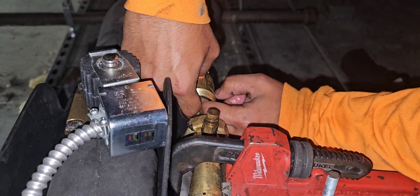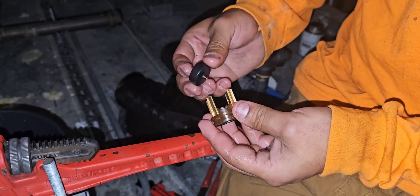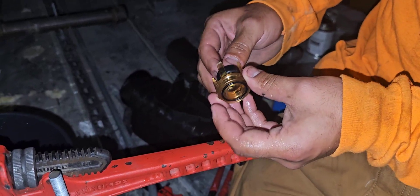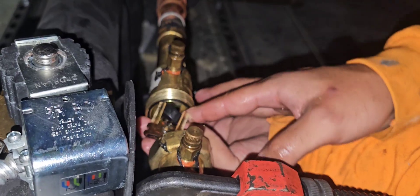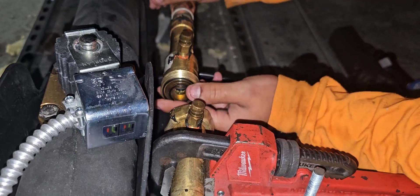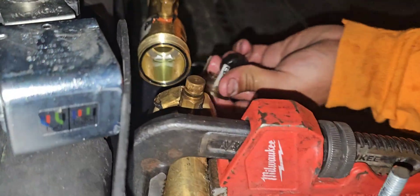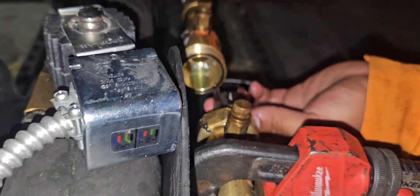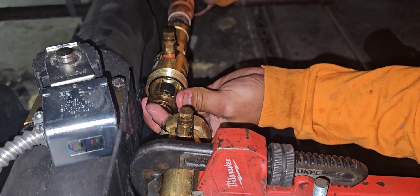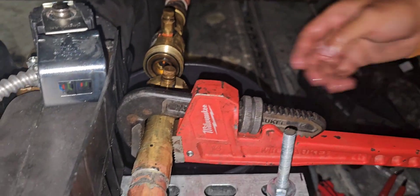The orange part goes into the orifice - other way. Okay, the orange part goes into your orifice, then that slides back into the valve against that crush washer. Don't worry about the O-rings necessarily until you get it all in. One thing I've noticed doing these is that the rubber diaphragm doesn't like to sit inside the orifice very well, so you've got to monkey around with it a little bit until you get it all to slide back in. There you go - you can see that orange tip right there.